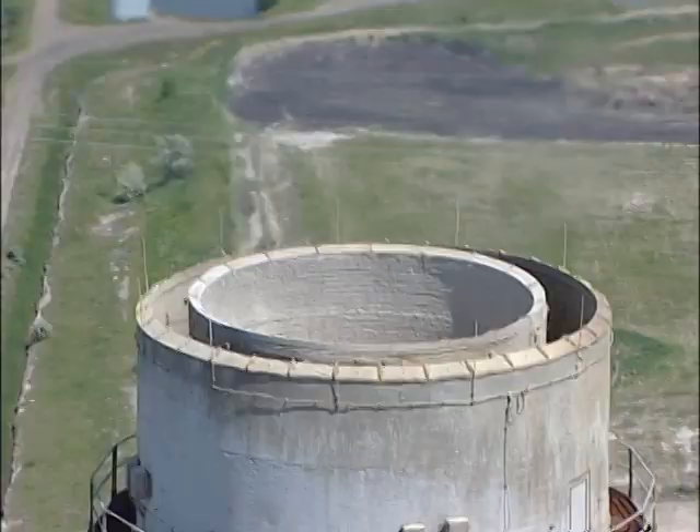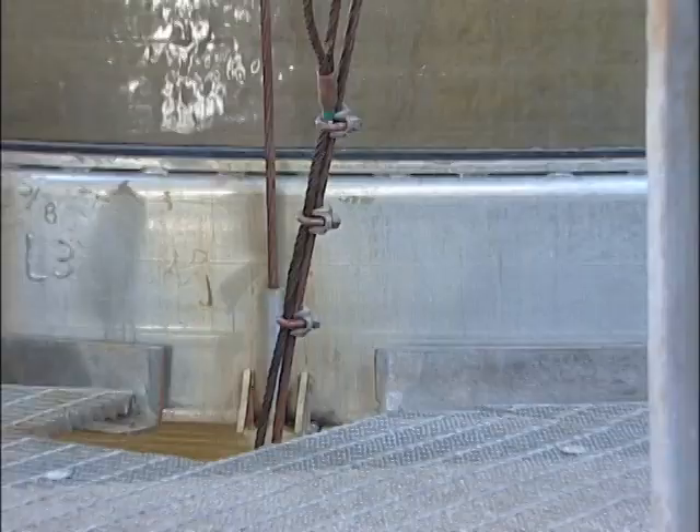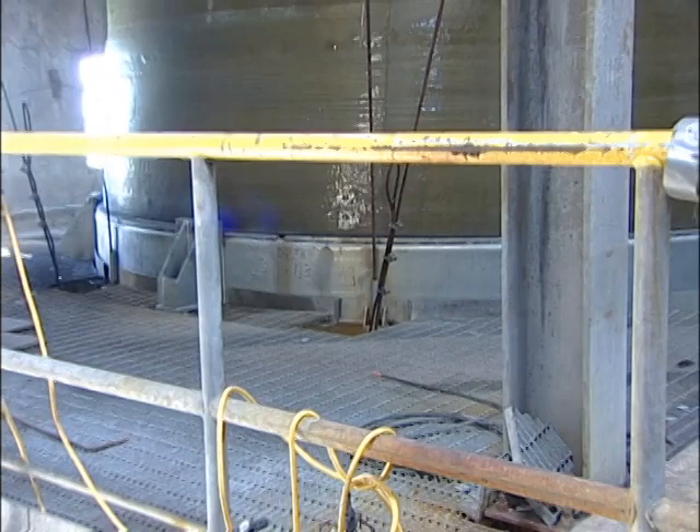The material is laminated fiberglass, not brick like the stacks that are used now at Leland Olds. The canisters are about an inch thick, but at the places where they're hung inside the chimney, they're about six to eight inches thick. They're basically hung from an interior platform at the 555-foot elevation, and there's also an expansion joint at 185 feet.